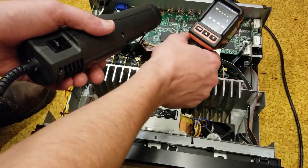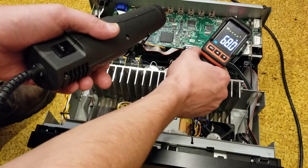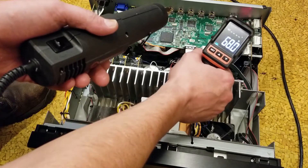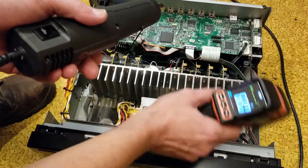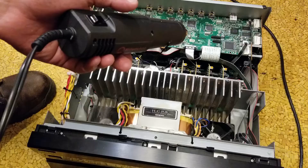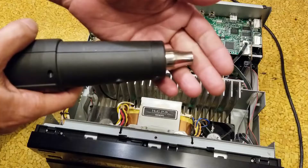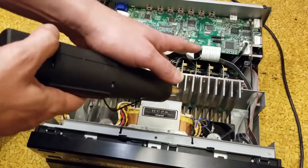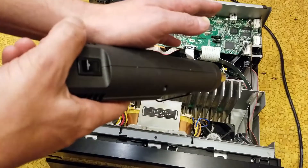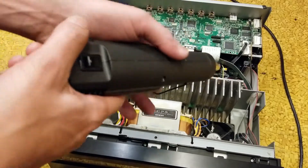You really want something where you can point at the chip. This one has a 20-to-1 ratio, so it's going to have a nice tight spot and good readings because it's a black chip — pretty optimal. So we're at 68 degrees. We're going to heat this up to maybe 150 or so and see how it goes. If you only have a hairdryer, it is so important to be able to tell how hot it's getting — otherwise it's a crap shoot whether you're getting it just warm enough to work for a little bit, or actually hot enough to cause the solder to remelt.